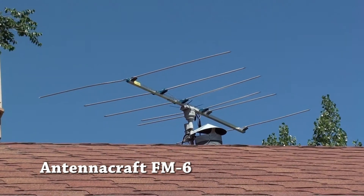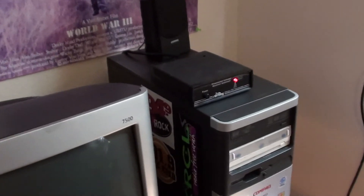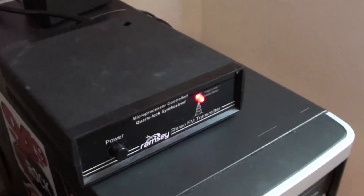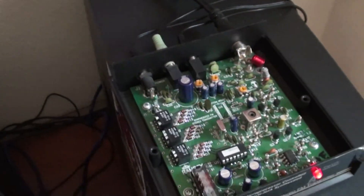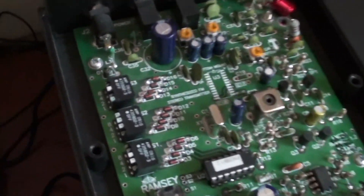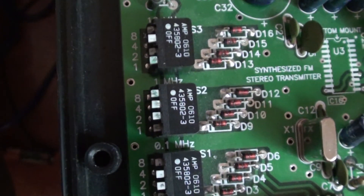My other antenna is used for receiving only — somebody asked me about that. The FM25B is a wonderful transmitter. I don't know very much about the other brands other than Ramsey, but this one works for me. To change the frequency, take the cover off and look on the left side. There are tiny DIP switches that are labeled — here's where the manual comes in handy.